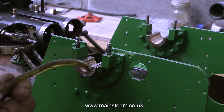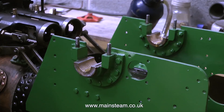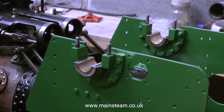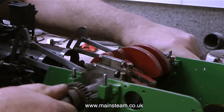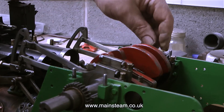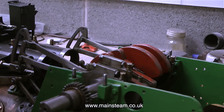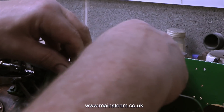Back to the Garret tractor and I'm oiling the bearings. It's very important before assembling any main bearings or any moving parts on a machine to always apply a good coating of oil to the bearings prior to assembly. Today's been a funny sort of day — I'm reassembling this Garret traction engine and I must confess traction engines are quite new to me. Over the years I've done quite a lot of work on miniature railway steam engines and stationary engines, but not on a traction engine. But to quote a cliché, it's not rocket science, so I'm sure I'll get there in the end.